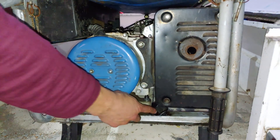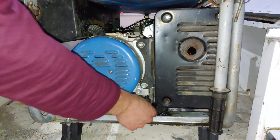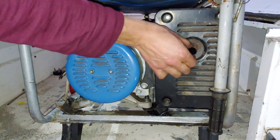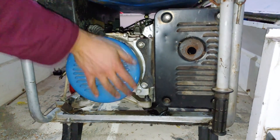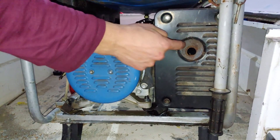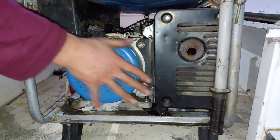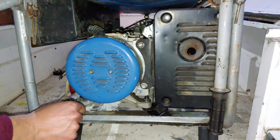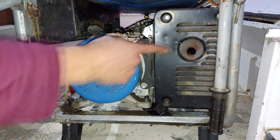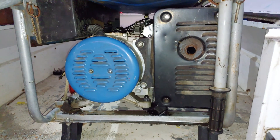When the alignment is done and you've aligned the mountings, you should see the exhaust is almost centralized. If I vibrate the generator, you can see even going in or out it doesn't knock on anything. I did have to play around with the mountings, shifting them here and there, but now start the generator and you'll see what I'm talking about.